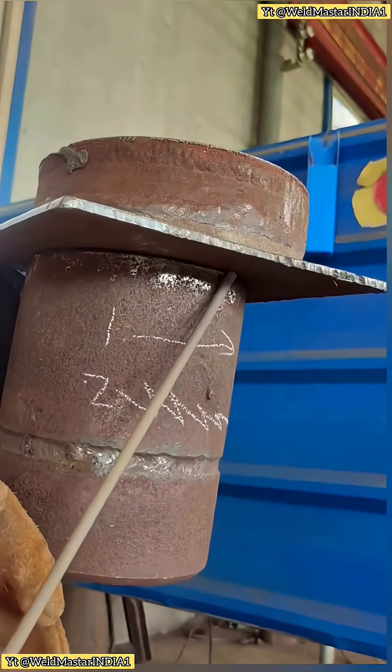Next, let's look at high-profile molten pool handling. This is called the double-sided method. When welding like this, don't keep the arc pool too small. Use a diagonal weave technique. Don't raise the rod too high at the back — if it's too high, temperature builds up and sagging happens. Instead, use diagonal weave to push and hold the weld properly.